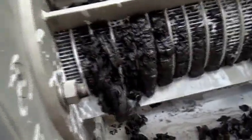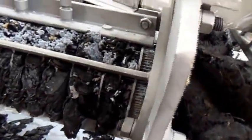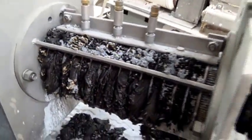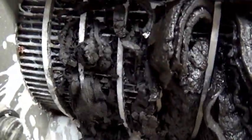We probably have something similar on this side of the screen. Here's the cake that we're getting — it's falling down here already. I'd hoped to get a stream of oil. I am filtering the bigger pieces out, and I'm getting a separation, though I don't know if that would be of any use to anybody. When we've done cuttings from frack drilling before, we've had an actual flow of oil come through at times. Here you can see at the inlet we're getting wetter stuff, and at this end we've got it a lot drier.